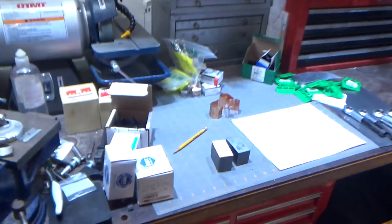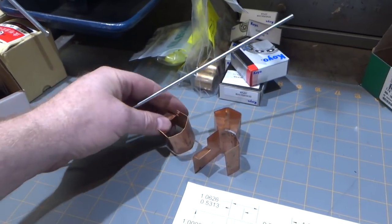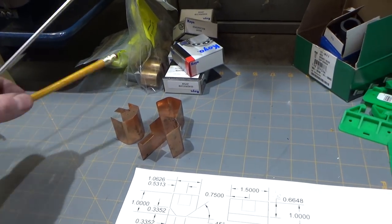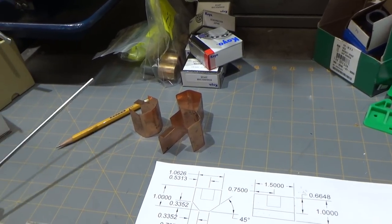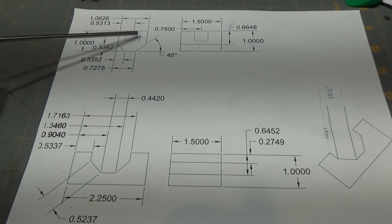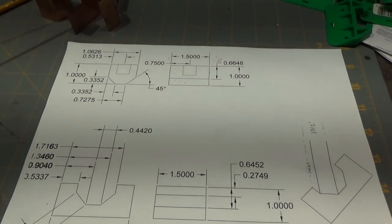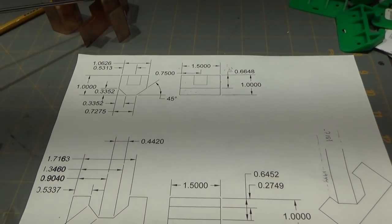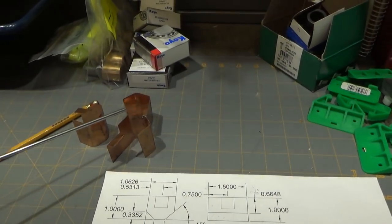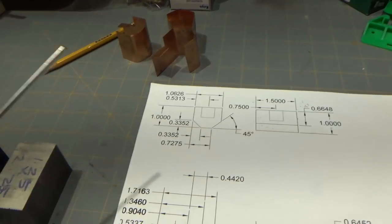What I've done in the past is I've made some copper soft jaws and just formed them around the jaws. But since I'm going to be doing so much work this time, and these are really delicate, it's pretty thin copper, what I'm going to be doing is making a die and a mold to make some brass jaws. And I'm only going to do this front section with a little bit of wraparound. And they're going to be held in place while I'm positioning the parts by a little flap that comes over with a rare earth magnet. So I'm going to try this out.